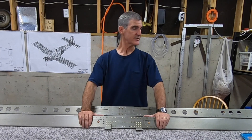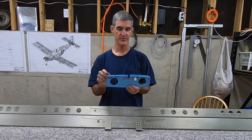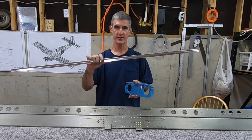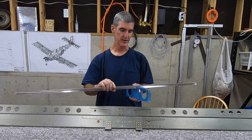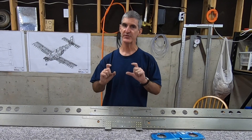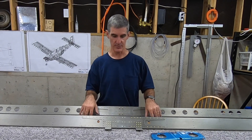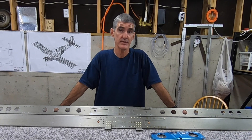I'm really happy with what I got done. The next steps are to take four of these INSPAR ribs and cut a notch out of them. That notch will be part of the box that you build using the long and short stringers and the thing called the stringer web, which is a little flimsy-seeming rectangle of aluminum that I'm sure once you create this box with it will be very strong - and that'll be sitting right in here. So that's what I'll be working on next time.